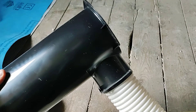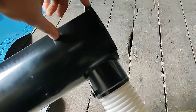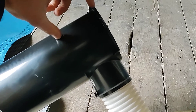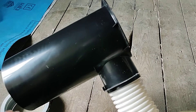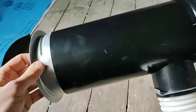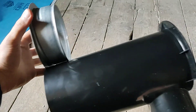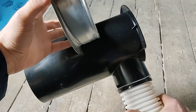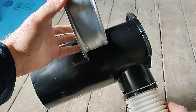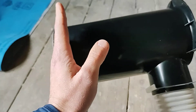This plenum is obviously quite long, but it can be cut down to 123mm minimum. The 123mm allows for this socket, which goes inside the plenum on the room side, to fit inside. This socket is about 45mm, as you can see. So this can go right down to just about here — you can cut it all the way down.